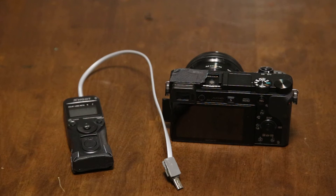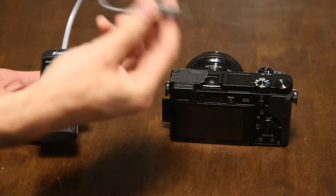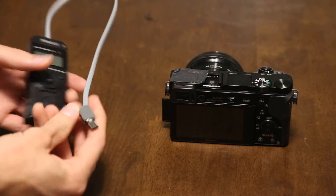If you use a timer remote with Sony cameras with the multi-connector, it turns out that you don't actually need batteries. To test it, I took an old Canon remote, sawed off the bottom, soldered on the multi-connector, and I'll demonstrate it really quick.